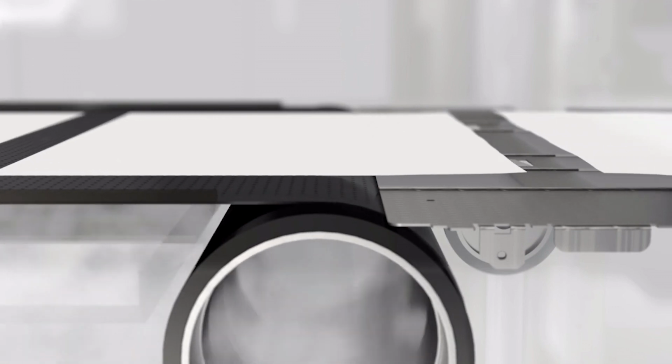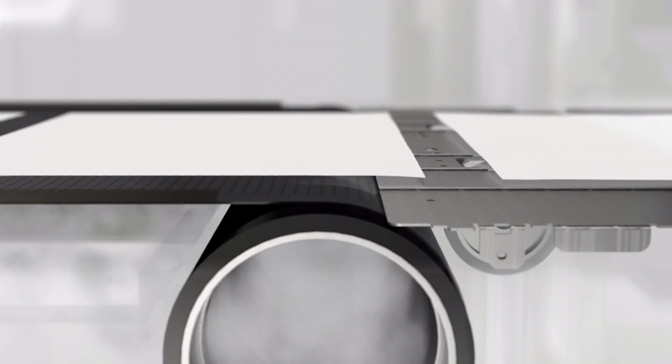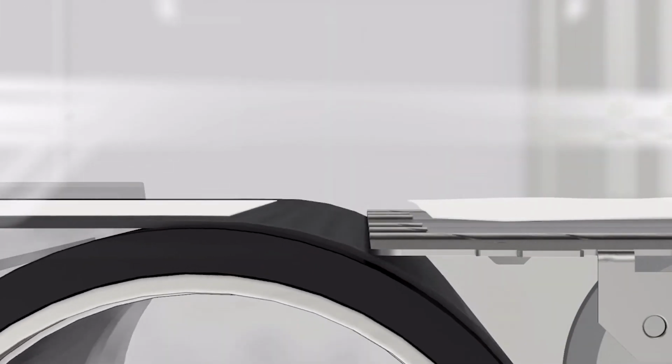The iX series uses an air transport mechanism based upon vacuum that holds the sheet perfectly in place on a rigid stainless steel belt that provides unparalleled precision, that has increased vacuum suction over the I-Series, so we can now feed the lightweight papers as well as the heavyweight types of stocks.